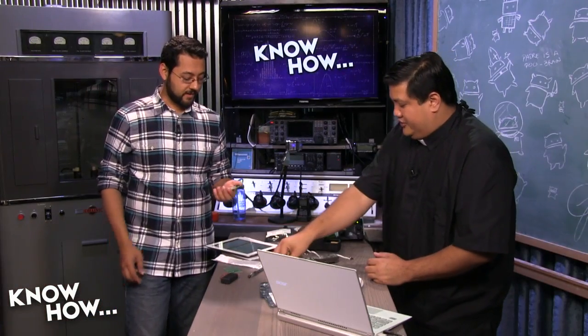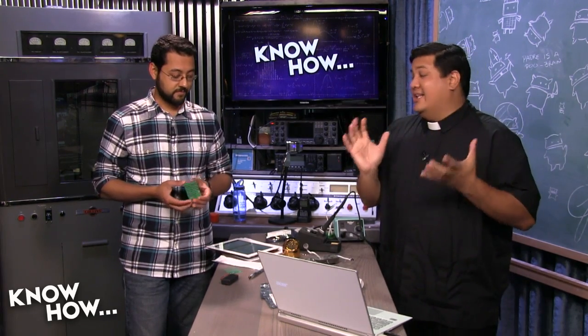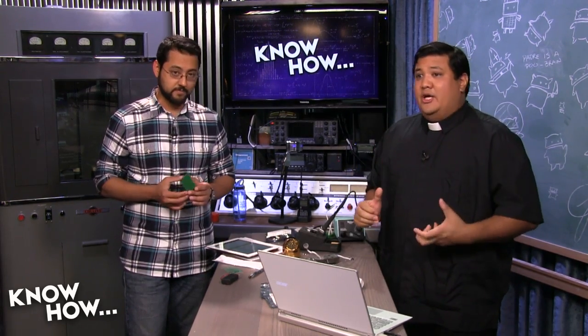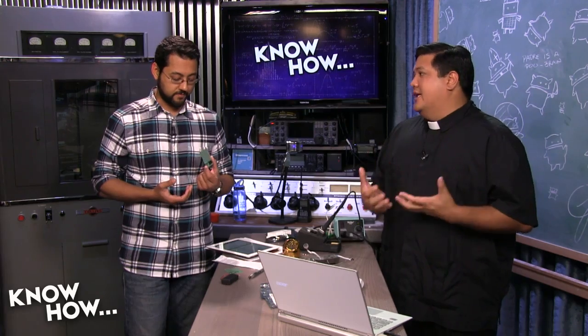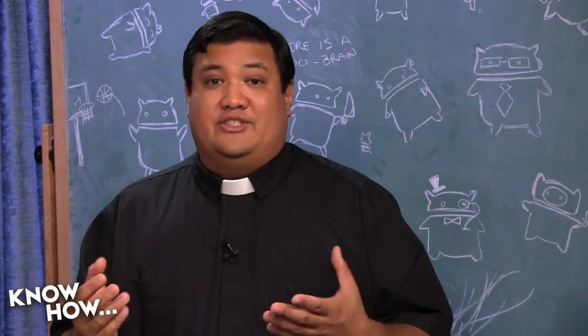I'm going to let you start soldering in some of these things. And I want to discuss a little bit about what an LED is and how it actually works. So an LED is a light-emitting diode. And as the name might imply, it's a diode. A diode is a dipole device, which means current goes in one way, it doesn't go the other.